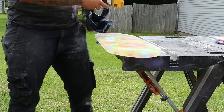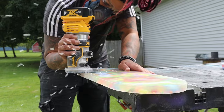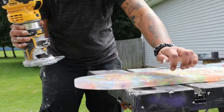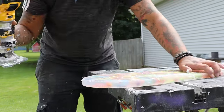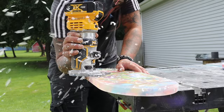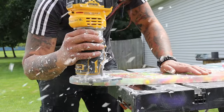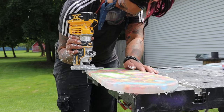Here is where I'm going to round over my edges, and I am using a half-inch round-over bit on this palm router. A lot of people ask me what this tool is — this is a palm router, like my plunge router but just small and handheld. This is the perfect size for hitting the top and the bottom; it creates a really nice rounded edge that meets right in the middle, and I try to keep my board's thickness just right so they meet right where I want them.